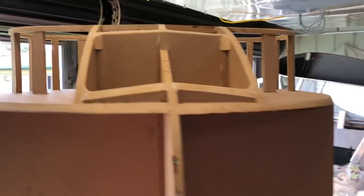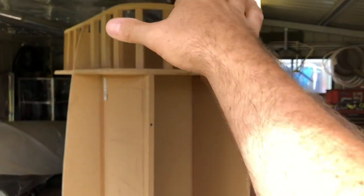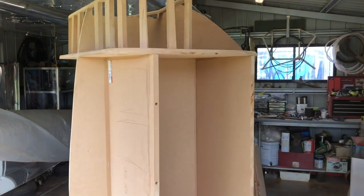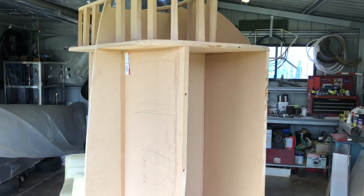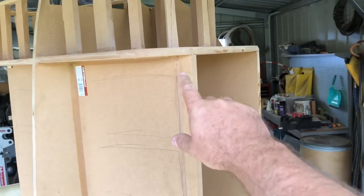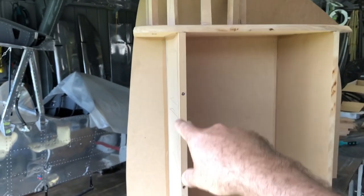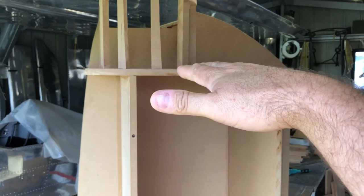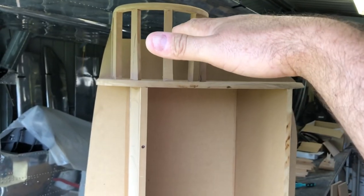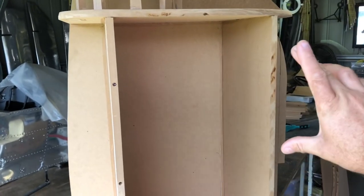And yeah, so I think the plan will be to start at the bottom skins and work my way up to the front, because that's how it's gonna look on the airframe anyway. So this skin will overlap that one and like that. The reasons why I've made these frames where they are is like these main ones here. And then that one there, that'll be the front part of the cowl where most of the shape will be. The top skin will wrap around to this edge here, and then the bottom skin's gonna go like that.